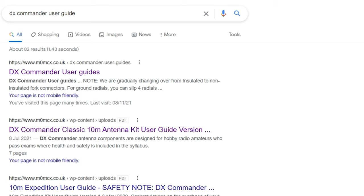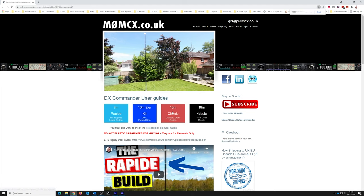Quarter-wave radiators have a superb pattern for low-angle takeoff — great for DX. The 40-meter element also works perfectly on the 15-meter band at 21 MHz, as it's a harmonic of 40 meters, giving you about an extra 3 dB of gain down low when used with a moderate ground. The user guide is available in PDF format and I'll be referring to it a couple of times in this video.